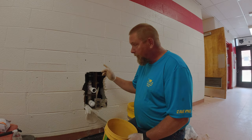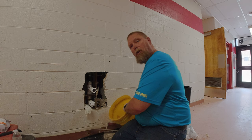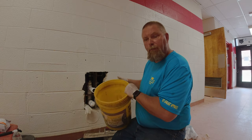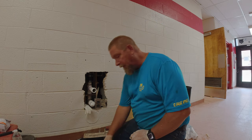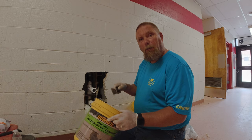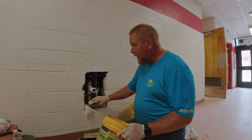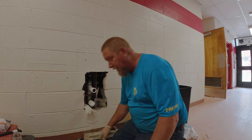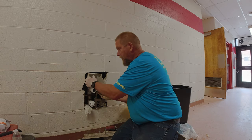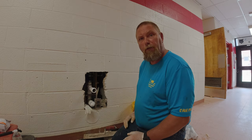The hole is probably 12 by 18, so we're going to take some of the pieces that we took out of there and use them as a filler. I'll stir up my concrete in the bucket in very small amounts at a time. We'll start from the bottom, work our way up, and I've got a pretty good sized piece I'm going to use kind of like a puzzle piece — stick that back in where it belongs, and use some of the smaller pieces as filler.